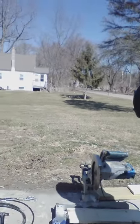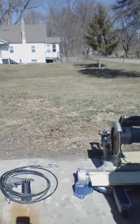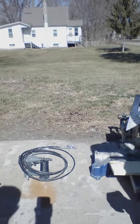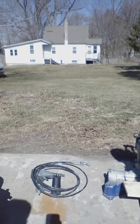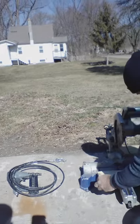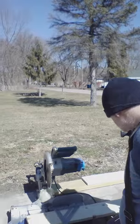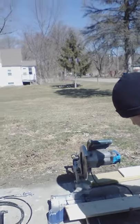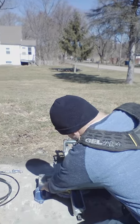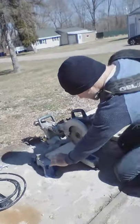So our floor is going to be 7 and a half inches. We made lines straight across by holding our speed square up along the side, and then we measured 7 and a half inches and made a line with our pencil. Now I will take and put it on the miter saw, get it lined up, and make a cut.